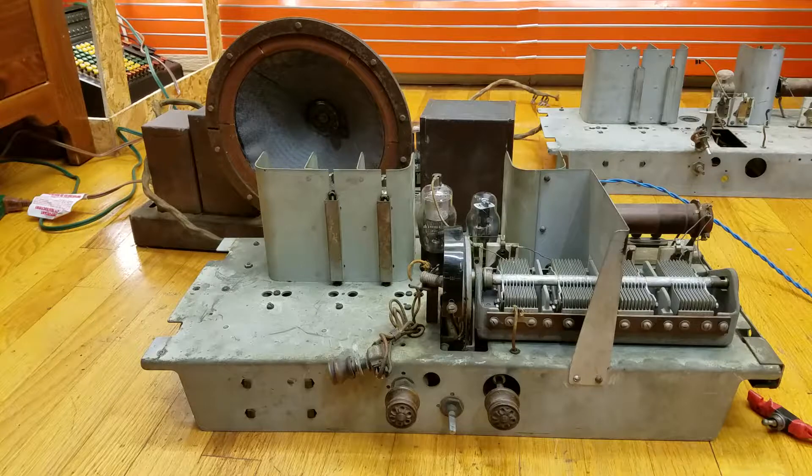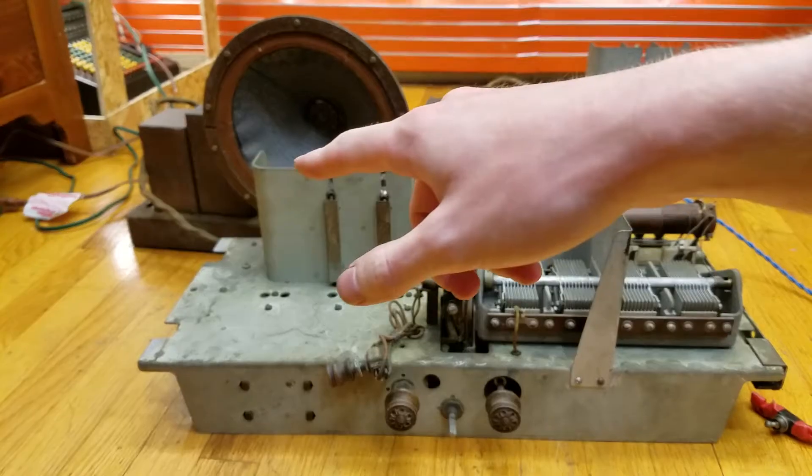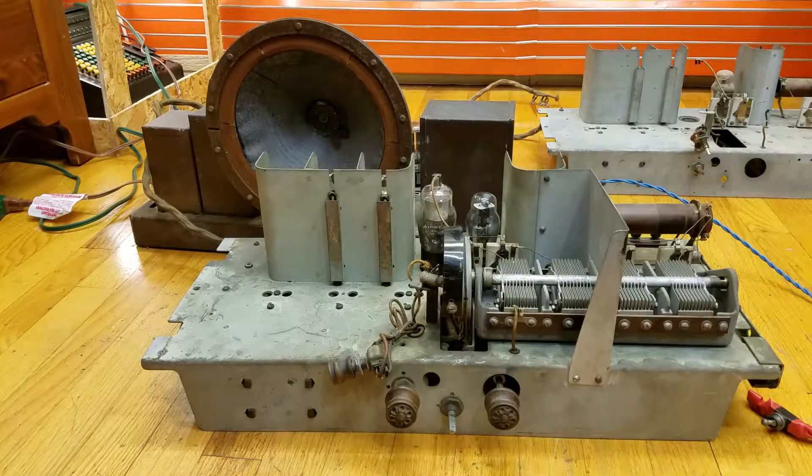You can see there's a large greenish cable back there at the left that connects the two chassis together. I first got these two chassis — the one in the front and the power supply — back in January. But when I hooked it up and tested it out, it didn't work. It turned out there were two bad coils in the receiver, two IF transformers.